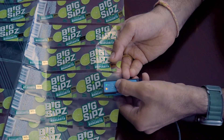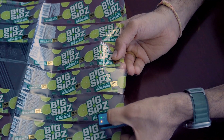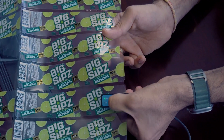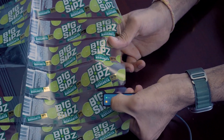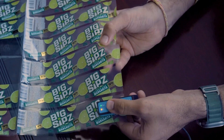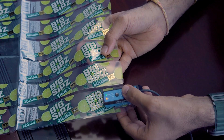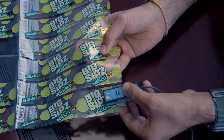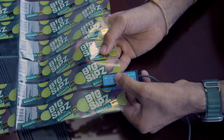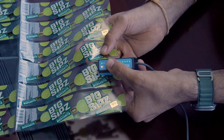Once you hold the teaching button for more than three seconds and release, then move it between the label and the substrate a couple of times, it dynamically learns what the required threshold is — just release the button and it automatically learns it. You can see every time I'm on the label it gives a high output, and when I'm on just the background substrate it turns off, and it very reliably detects it no matter where you go.